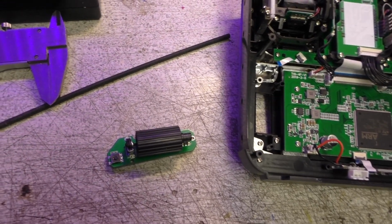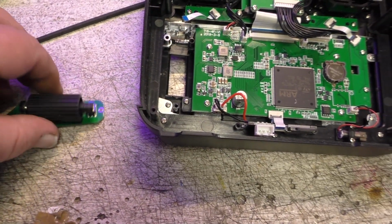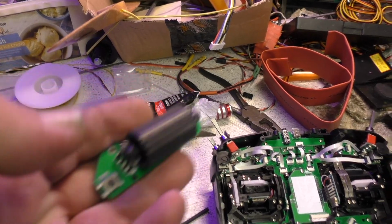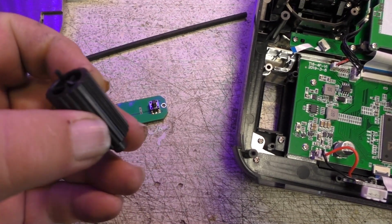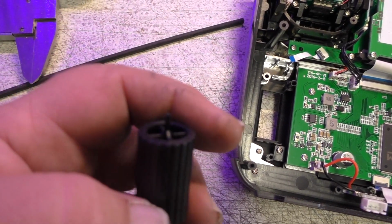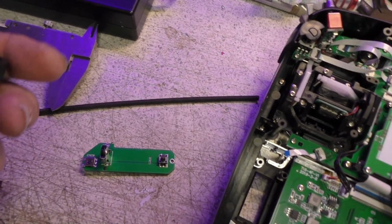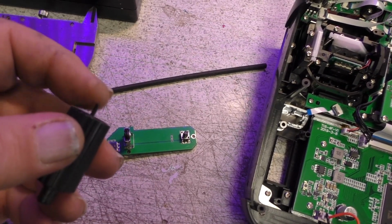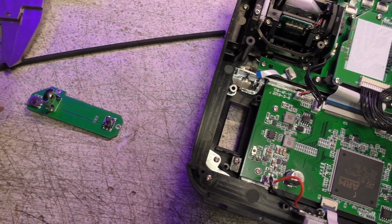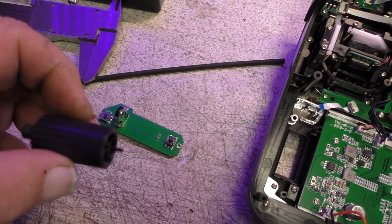Oh yes. So here is the wheel assembly for people that have not seen one yet. It's a circuit board with a roller and an encoder at the end. And the roller there has got a hexagonal end on it that fits into a hole in the encoder. Now, by the way, this is actually quite loose, and when I got mine, I actually put a bit of rubber glue on the end of this so that it took up the slop that was in the encoder, because you can get probably like 10 degrees of slop